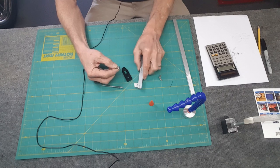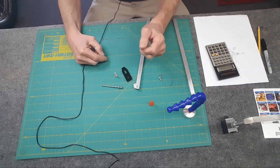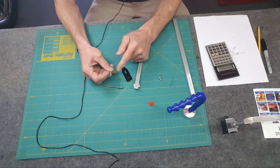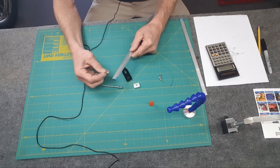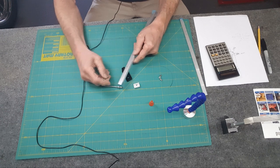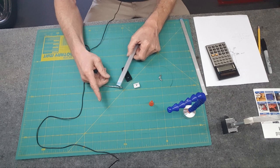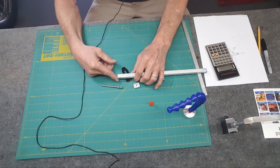I was going to use this piece of stock — not much to remove but the thickness is right on the limit. I'd put it in there, machine one side then the other, but when I flip it over to do the 45° chamfers I don't have much to hang on to. So that one was out and I went to my favorite metal supply and got this larger piece. I can clean up the sides to get it to width and cut the channel deeper so I have something to hang on to, then cut the chamfers. I'm pretty sure I can hold it in the vise this way.